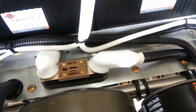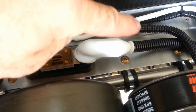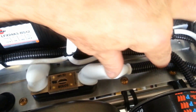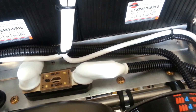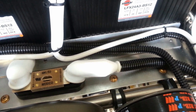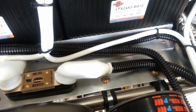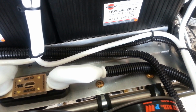The amperage shunt would then, if you use it, we don't show it here, you would jump from here to the input of the shunt, and then exit from the shunt, and then to the alternator. And then on each side of the shunt, there will be a little wire that goes to your instrument, and that's what actually measures the voltage drop across the shunt in order to tell your instrumentation, as in the Viking View or your Dynon, what the amperage is.